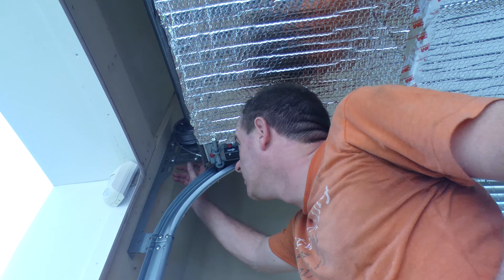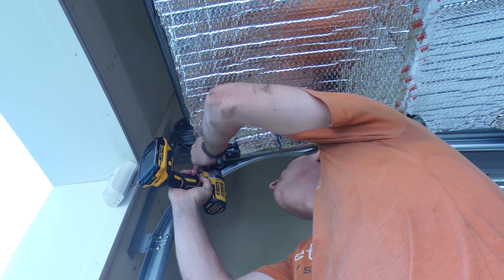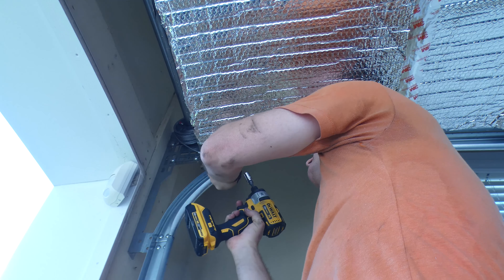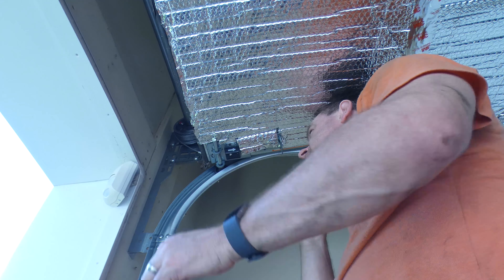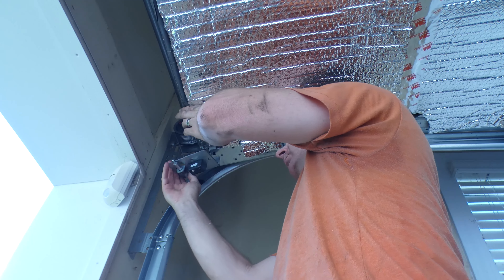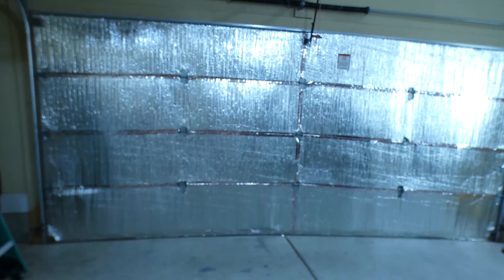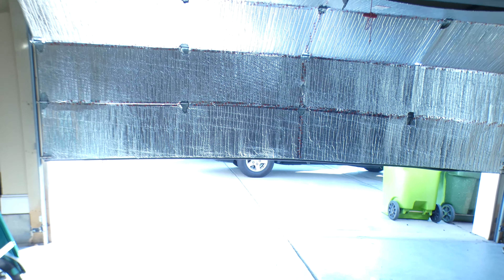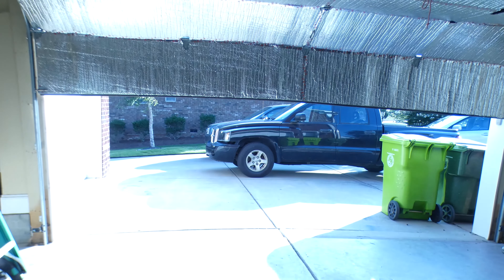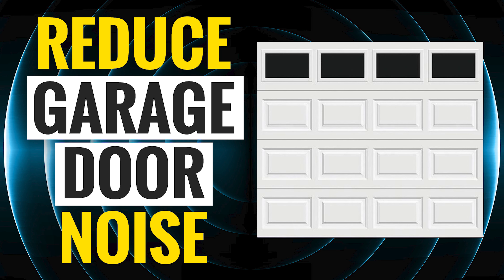That'll take care of the majority of the noise from your garage door, minus the noise from your actual garage door opener. There's basically one different wheel you have to do, and that's on the very bottom. To get to it, raise your garage door to the top. Make sure it's supported by something like a two-by-four, and make sure the cable is loose — if it's not loose with slack in it, abandon this technique and get someone with more experience. This cable is not supposed to be tight when the garage door is at its peak. Raise the door up, support it with a two-by-four for safety, then remove the bracket and replace the wheel just like the others.